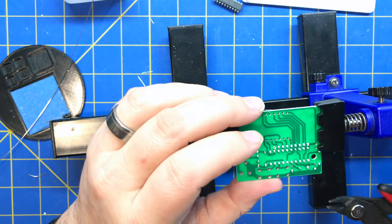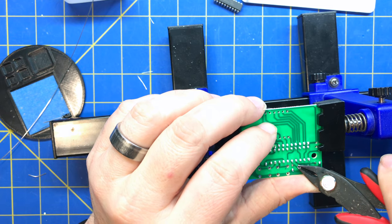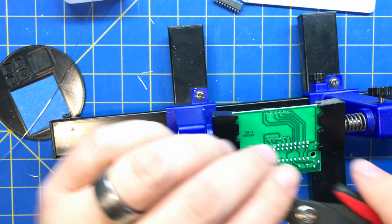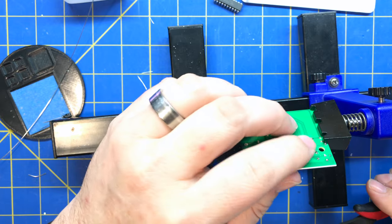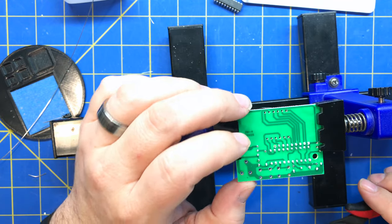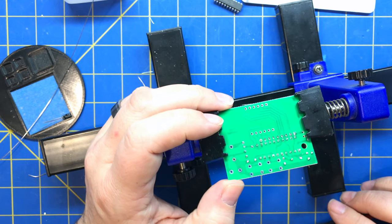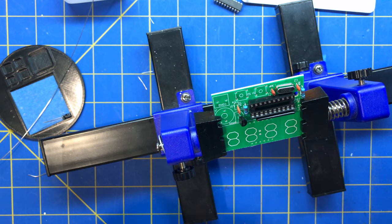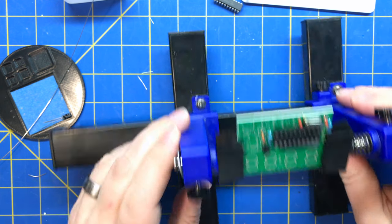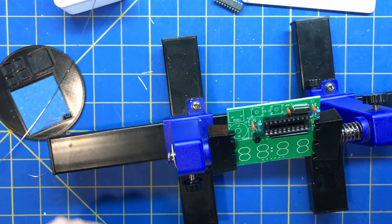So, that's that. Sometimes I'll even, you're not supposed to do this, but I'll clip the solder tips off some of these if they're sharp, if I know they're going to be taller than everything. You can always hit it with the soldering iron afterwards, but you never want to do that if you're producing something, because you'll create weak joints. You can crack the joint and it could fail catastrophically if it's something important.